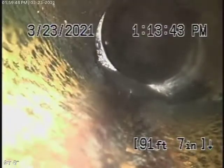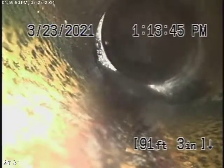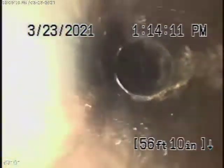There's a slight little dislocation but nothing serious. This pipe's actually diving at a very good grade — you can see it being kicked going downhill all the way there. So it's a very good grade in the street. This looks pretty good — nice and clean line. Nothing majorly wrong with it, that's for sure.